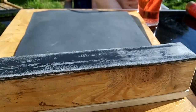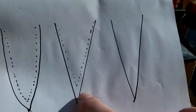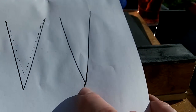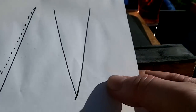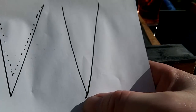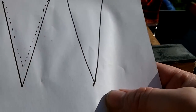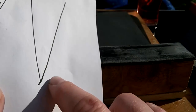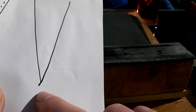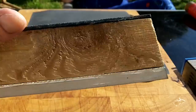I've been talking about convex and V-grinds. A convex grind has an apple seed profile; a V-grind is dead straight — the type you get from the Edge Pro. Then there's the wire edge: when sharpening from spine towards edge, plastic deformation of steel pulls a little bit of steel all the way forward and over the tip, curling it in the sharpening direction. Sharpening from the other side flips that wire edge back. At the very coarse grits when setting an edge, deliberately make a wire edge, then strip it off by drawing the knife edge through the end grain of a piece of pine — just lightly slice to break off that wire edge.